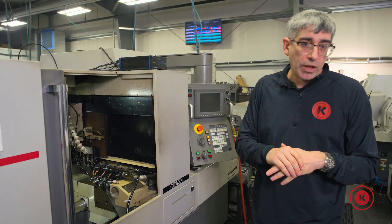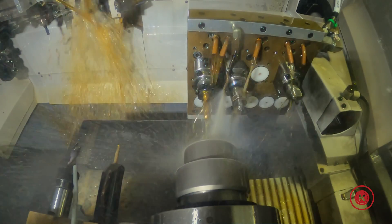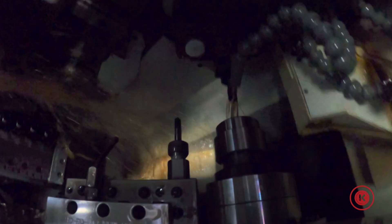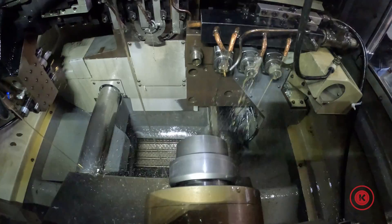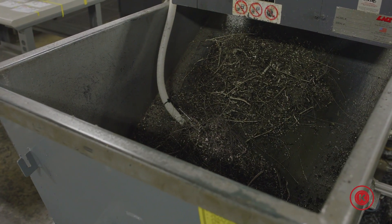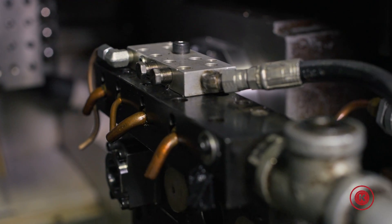To rehash some of the things we like about this machine: it runs up to 32 millimeters and handles about 90% of the products we have here. The other 10% that are either highly complicated or require a ton of milling, we move over to our L32. Really tiny stuff goes to our K16. But in between that 16 millimeter and highly complicated work, this will do just about anything. It's got a nice amount of torque for broaching and heavy cuts, an exit conveyor for scrap that lets us run continuously and lights out, and a 12 foot auto bar feeder. Just a well put together, consistent machine for us.